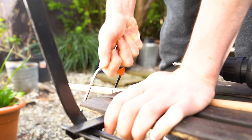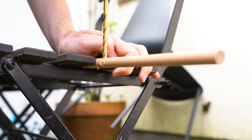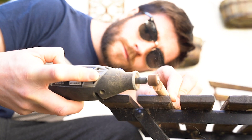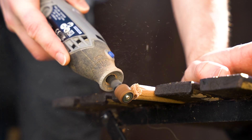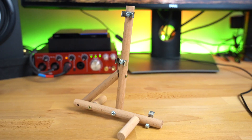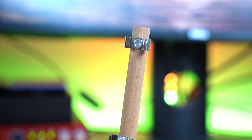I just so happened to have two LED strips available when I started the project, so I took the opportunity to link the spare strip to the bass drum. Given the bass drum is usually the biggest drum in an acoustic kit, I gave it the most LEDs in this case. So I set about building some stands which would hold the aluminium channels which would hold the spare LED strip. A face full of sawdust and 14 metal clips later, the LEDs are ready to stand on their own. For the stands I just cut up some simple wooden dowels and screwed them together and used some metal clips that came with the aluminium channels.